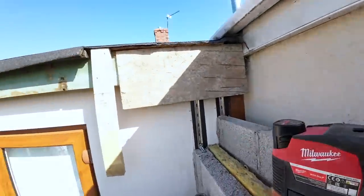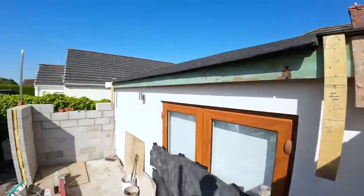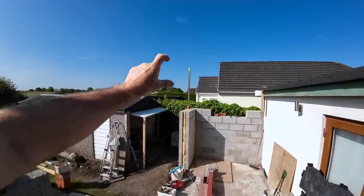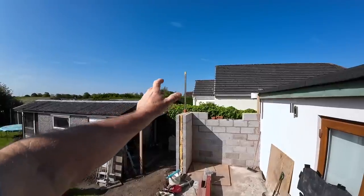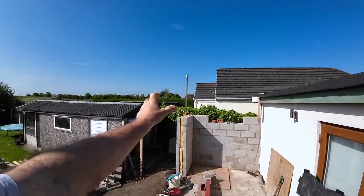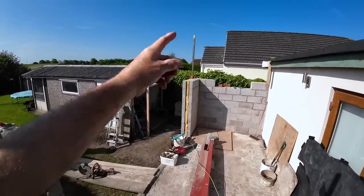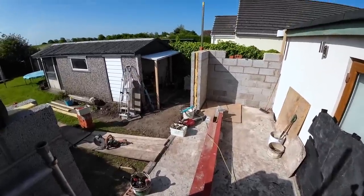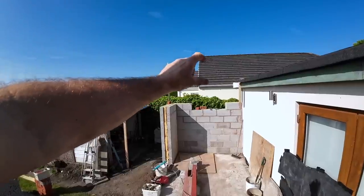So yeah, I'm going to hop across the other side and get that side done, and then we can work the cuts out. Then I think we've got a 150 cut underneath the pad stone. And then it's a 150 pad stone, and Danny wants us to put the pad stone from front to back. So we'll sort those cuts out, and then that'll be going off overnight, ready for that to go up tomorrow, and we'll get the trestle set up for us all to throw that up tomorrow. It's not a large steel that, so it shouldn't be too bad. And window in there, just 2/4 block deep. We've got the lintel for that too.